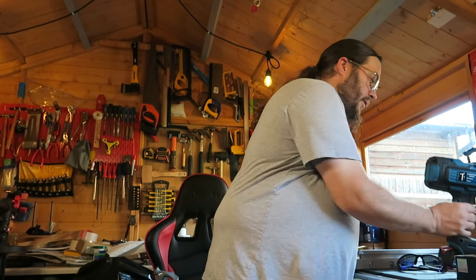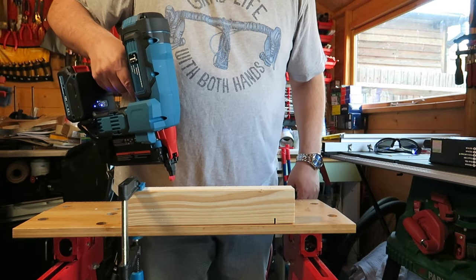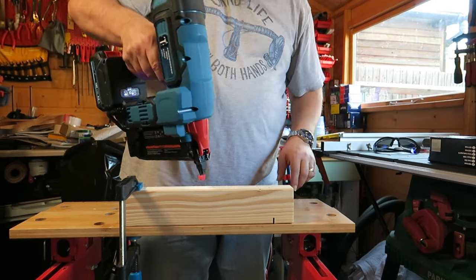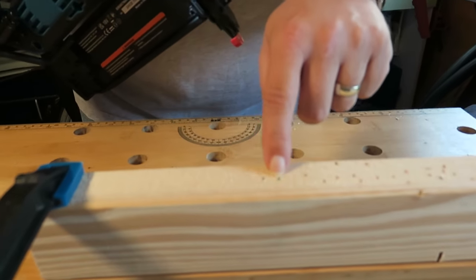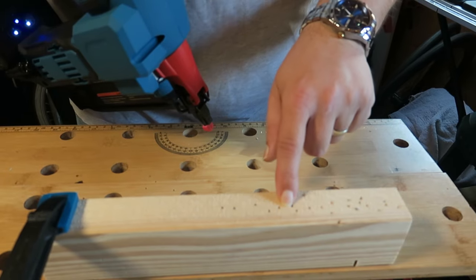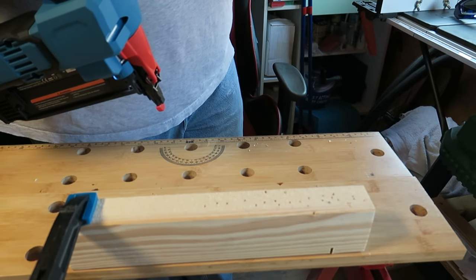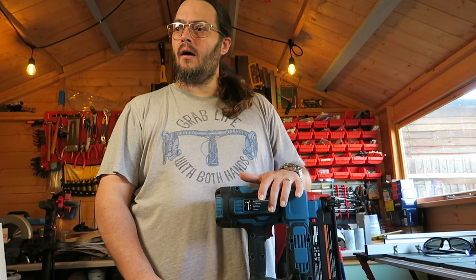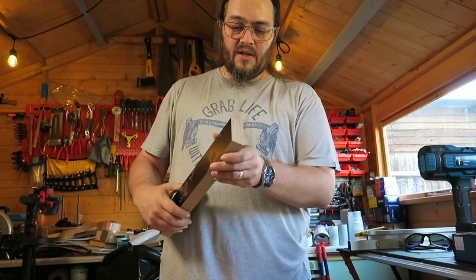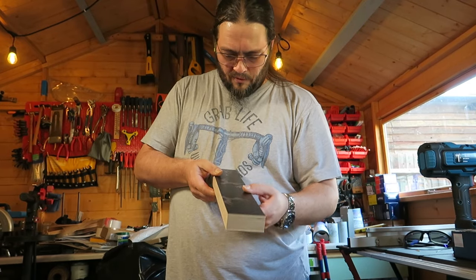Let's try turning the tension down and see what happens — one full turn. Nope, still went through. Another full turn. There's the nail head right there — perfect. Look at that, you can just barely feel it. Compared to these others which have completely disappeared into the wood. I need hardwood — let's see what this does in hardwood. This plywood here is 29mm thick, it's really stupid-thick plywood and I think it's waterproof.